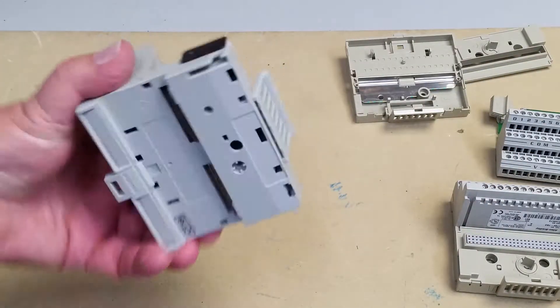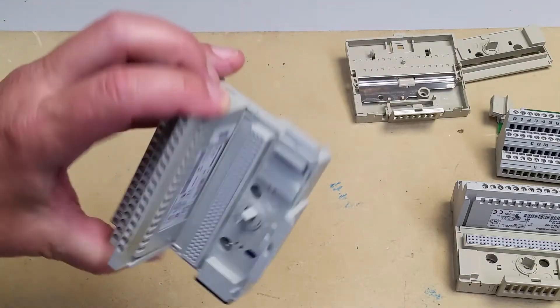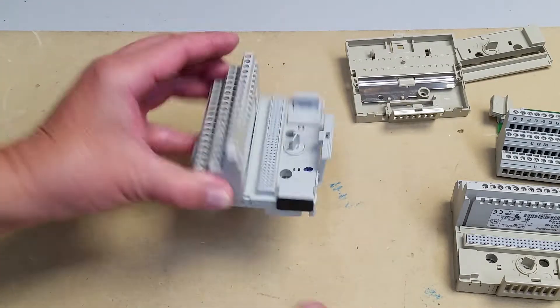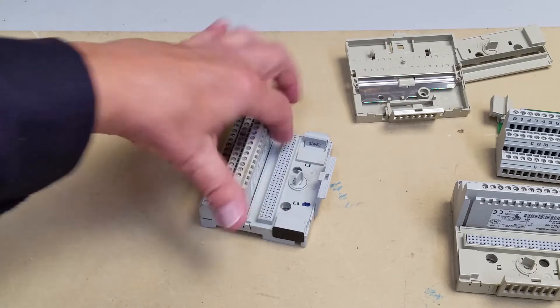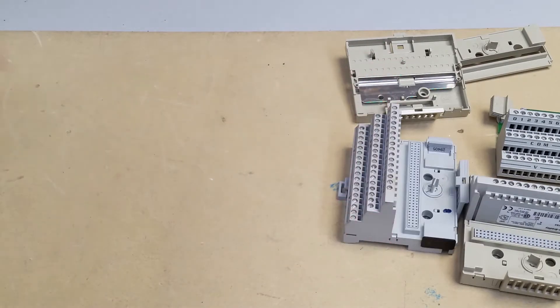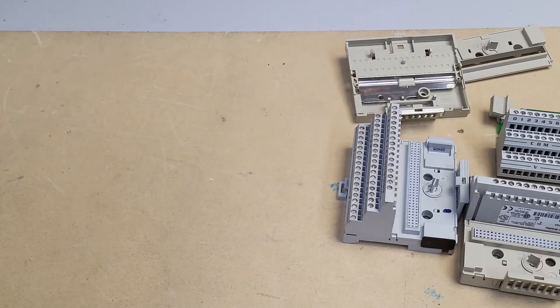So there we go — a really quick explanation of how to put these back together and why it's not worthwhile to take them apart. I said I was going to take one of these apart, but I don't want to break anything more on them. Right here is where these things break, and that's normally because someone has opened them up trying to figure out what's in there, or they think they have to pop those off to get the module out — which is wrong. Next video is again with the 1794 — I'm going to be doing the IR8 temperature module. Thanks a lot, subscribe if you'd like.